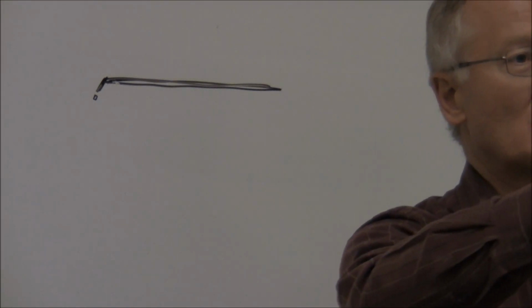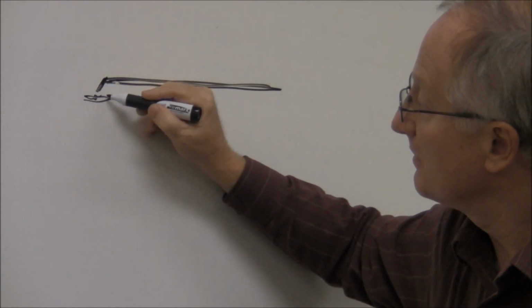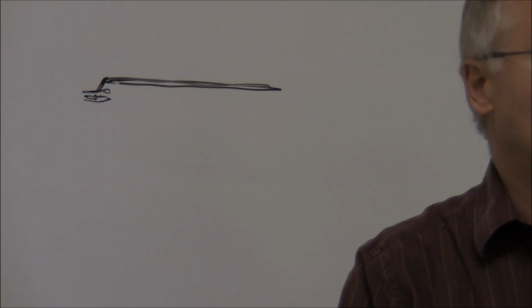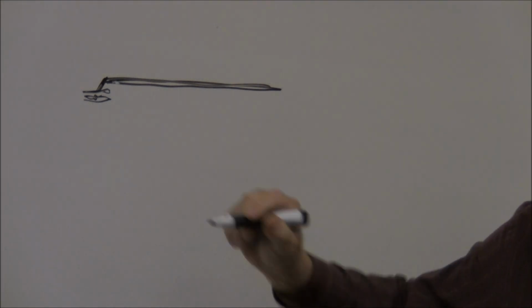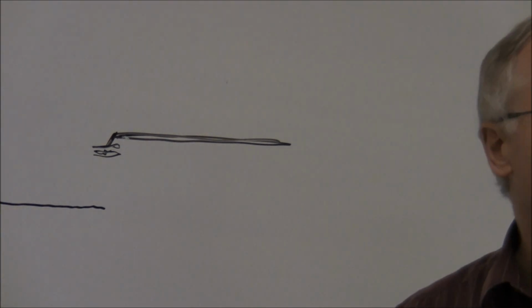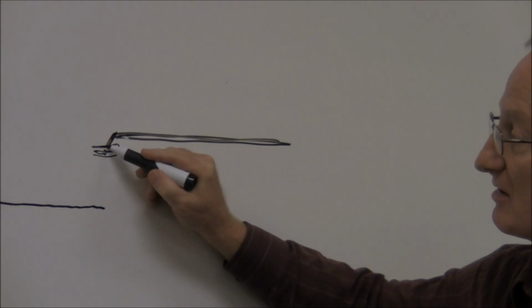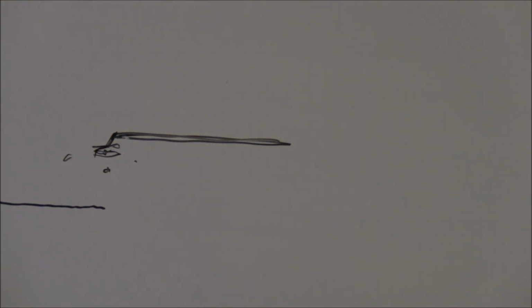So the light will be shining right on top of your work. As you're going down the side, once that laser falls off the edge of your work, you know you've got that much to go. If you keep going, you're going to go right through the side. A lot of times people will follow the laser right on the top of the edge of their work. They won't let it fall off. But you can adjust this to whatever distance you want, and that's what this piece on the top is for. There's a wing nut on it. You can push it off to the side, you can pull it out, you can do whatever you want with it.